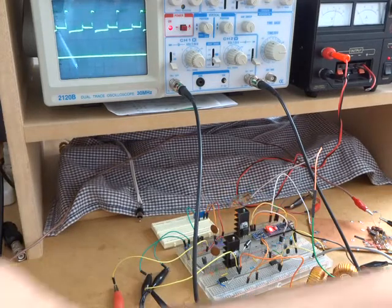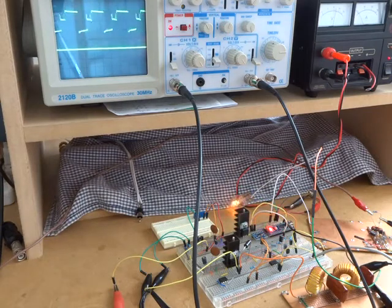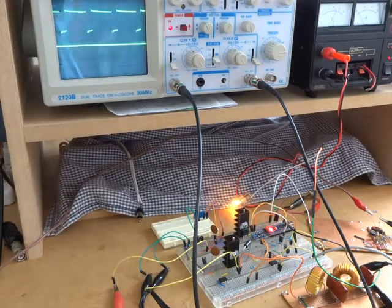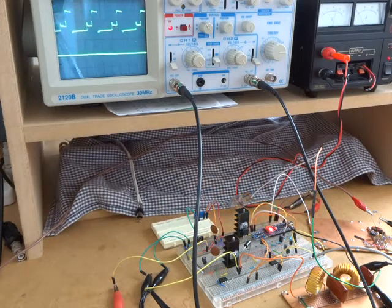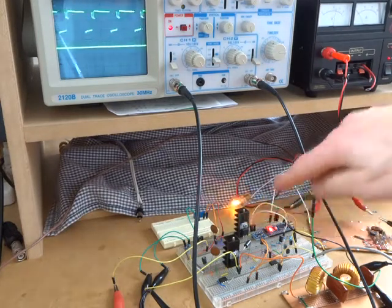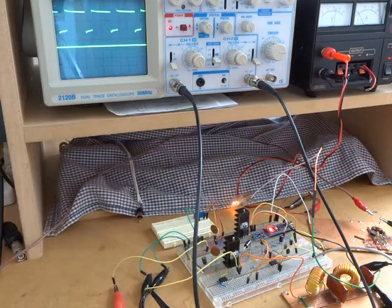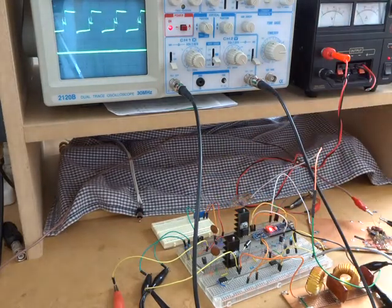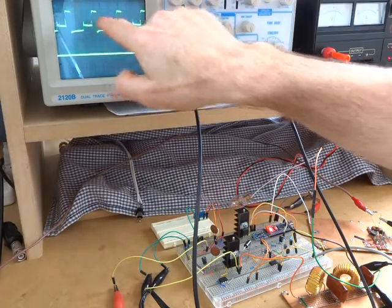Now, what did I say it was yesterday? It's an MAQ00352, so it's supposed to be a fast switching diode used for rectification purposes, and if I recall, I do remember seeing that particular diode being mentioned on one of the websites somewhere in one of the designs. But I'll be curious to know what diode you use, and I might try and source that one. At the moment, you can see down there, there's only one MOSFET and one diode. So if I now just crank down that drive a couple of 100 millivolts, we get back into a linear region there.